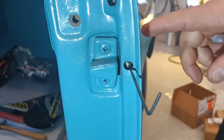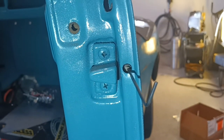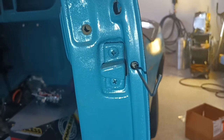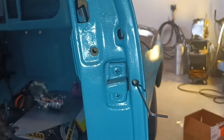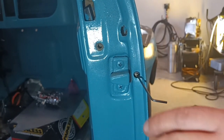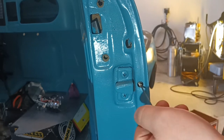So the last thing is the lock on this side. There is a little tiny Allen in there that is holding the lock on - it is a 3/32 head. Ours was pretty well seized in there. Right now it seems to be turning fine, but I did have to use pliers to hold that to get it to break free. That lock maybe has never even been removed or even touched, but nonetheless we have finally got it to break free.